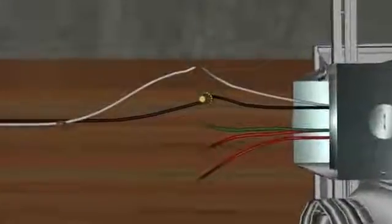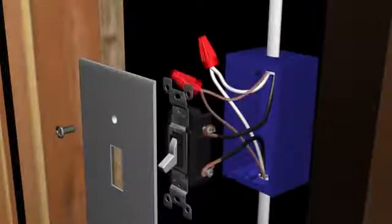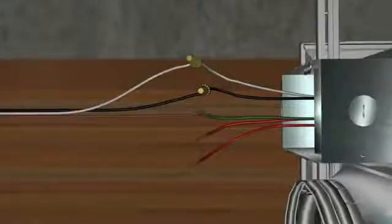The neutral conductor, the white cable, is connected together at the switch box and continues to the fan's junction box where it is connected to the white lead in the junction box. The ground wire is brought up to the wall switch and continues up to the ground lead — the green wire — in the fan's junction box. The two red wires remain untouched; there's no need to do anything with them. Simply leave the red wires capped separately and tucked into the junction box.